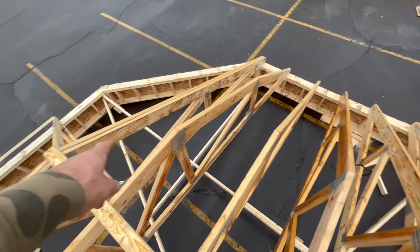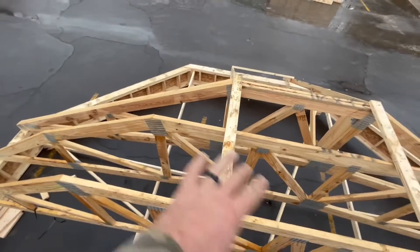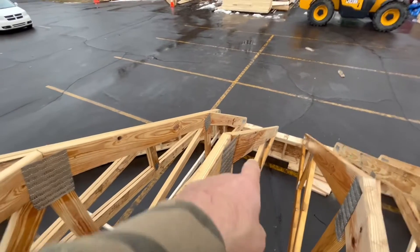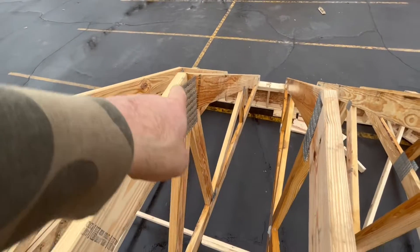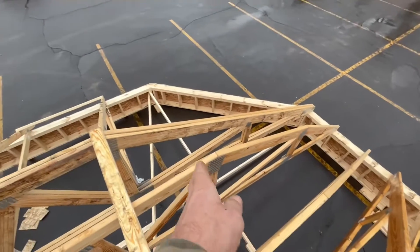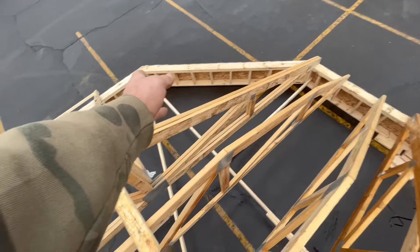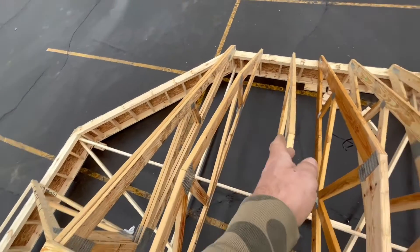The profile of this will be an octagon — a flat octagon platform up top. You can see how the trusses are all broken up into different pitches. This truss is one pitch broken into two pitches so it can plane out to that corner where the hip would land. And then this point will plane out to that one. So it takes what would be a nice clean hip number and you have to start it, stop it, start it, stop it.